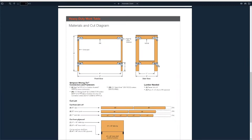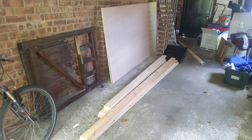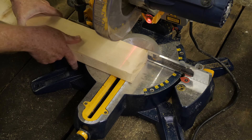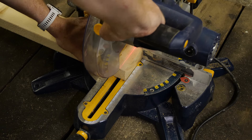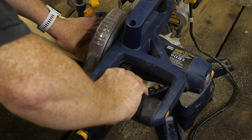Putting these measurements into Simpson's online tool gives me a timber cutting list to go and buy. The result was three 3m lengths, four 2.4m lengths of CLS, and two full size sheets of 19mm ply. Before I measure anything I start by cutting one end of each piece of CLS true in the mitre saw. I have it set up really well to cut a right angle, so this is a quick, easy way of getting a good starting reference, and I've already checked that I have enough allowance for this and the sizes required.